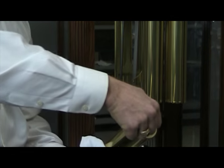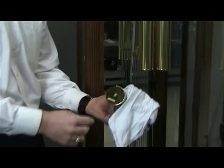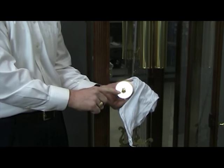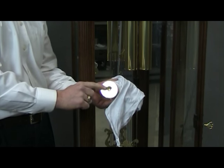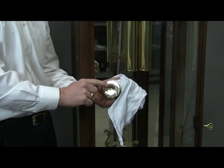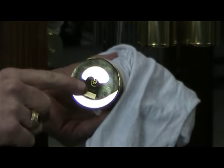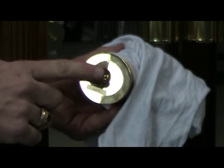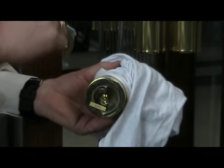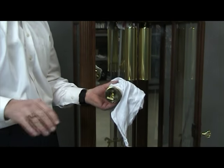Make sure the weight is securely fastened and check the bottom of the weight. The bottom should be marked with its location as you're facing the front of the clock — this is important because each weight weighs a different amount and needs to be reinstalled in the proper position. If it's not marked, make a little label and attach it with a piece of tape. Once all three weights are removed, marked, and labeled, put them in a safe location.